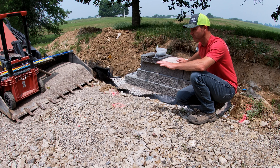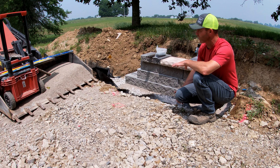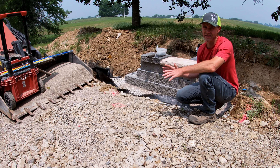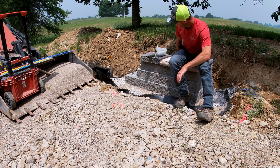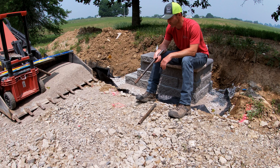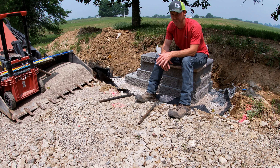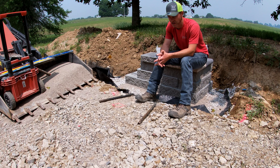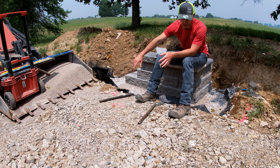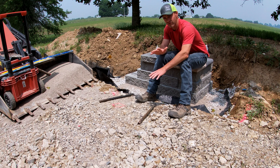It's Almond Landscape. Hey folks, we're here. This is a small wall we built. If you saw the wall basics video we put out, a small demonstration we built is one of the many things we built through the day talking about principles of construction in our in-person training class and our online training resource. What I want to show you is the trick to getting these wall projects perfectly level and with a lot less effort. What it comes down to is just like you screed out for pavers, we screed out for our walls. It's the same deal. Based off all your standard principles that you see in other videos of ours, Hardscape Academy, the NCMA, and all sorts of information out there from other great resources.